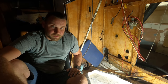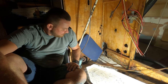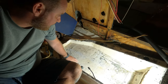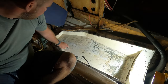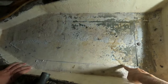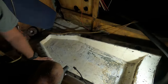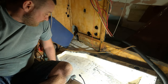Every time we come into the boat, we can still smell old oil from the engine. It's trapped underneath the oil sump and there is no access into it. So we decided to cut the bottom of this oil sump. I marked the lines around the edge, leaving about two inches. When we finish with the bilge, this will become our support for new glasswork to close this area. So now I will use a multicutter to make that opening and see what is there. I can bet it's pretty disgusting. Hopefully we will be rid of the unpleasant smell.